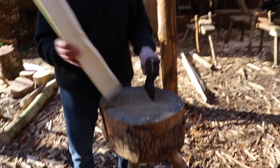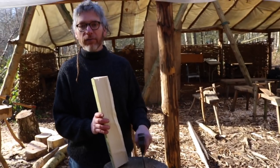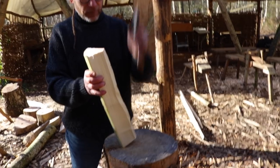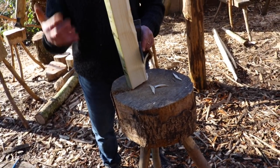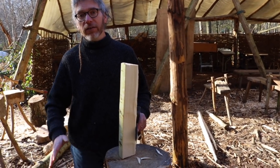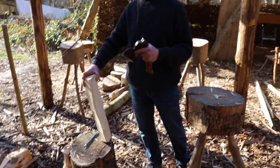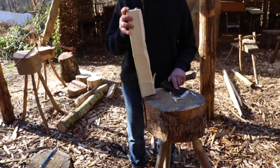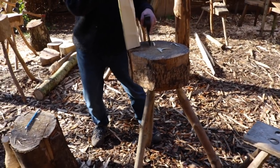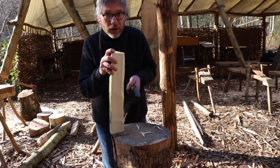The chopping block is basically a lump of wood with three legs. You want it at the right height — ideally so you've got a nice straight back and you can just let your axe come up and drop down. When I'm producing items, I'll have three or four chopping blocks of different heights so I can move longer pieces along while keeping a straight back. Stand with a nice wide stance to one side of the chopping block — if you miss, you want the axe to go down the side of your body, not into yourself.